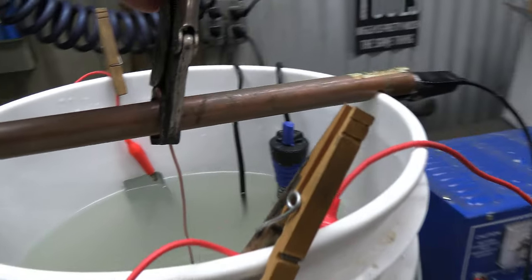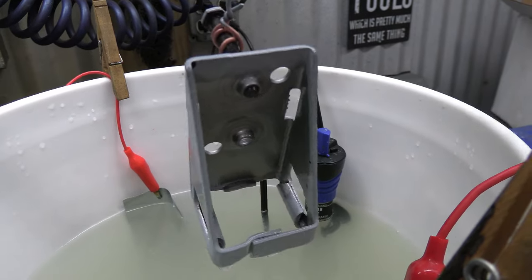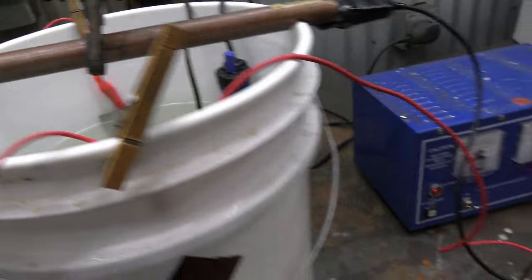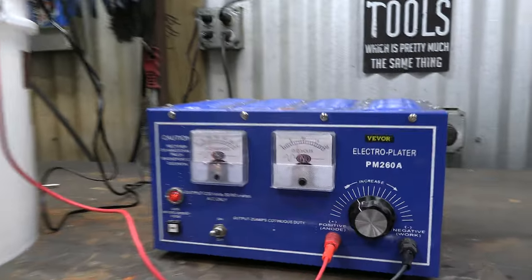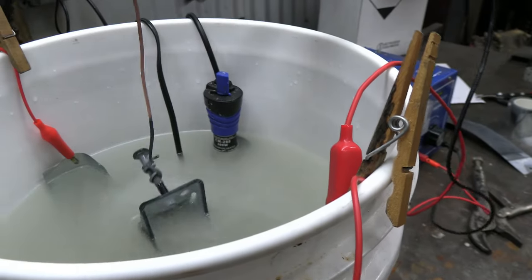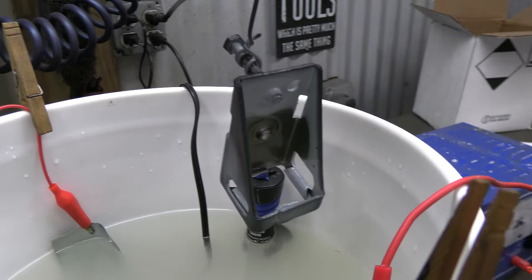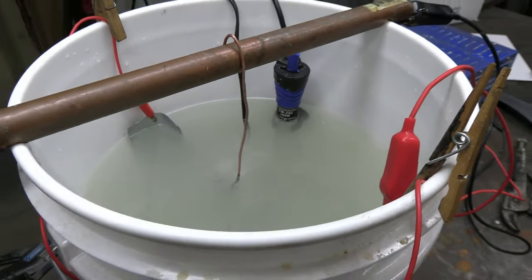After a couple of minutes, let me show you how I know I don't have enough amperage. You can see it's plating around the outer edges but it doesn't want to plate towards the middle — to me that generally means you don't have the amperage up high enough. So I'll come over and crank it up a little, maybe between four and five. I've now cranked my amps up to ten, which is definitely too high — it's causing the plating to occur better towards the center, however it's building up the crystal zinc structure on the edges even worse. So I'm going to try rehanging it from a different spot and see what happens.